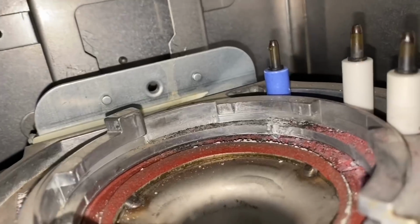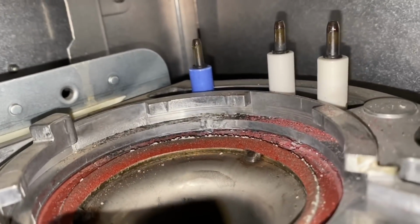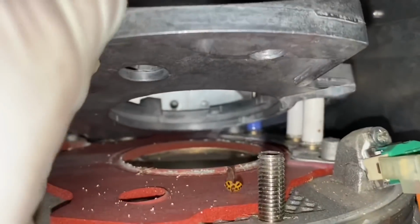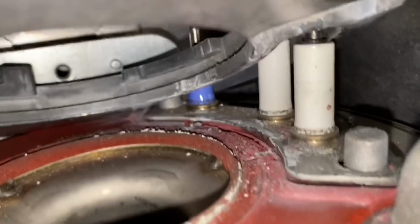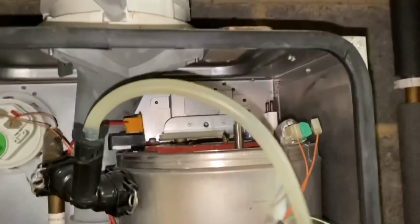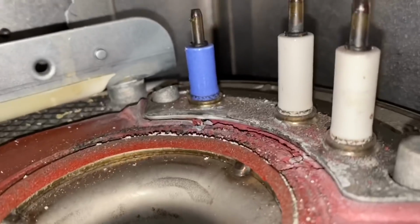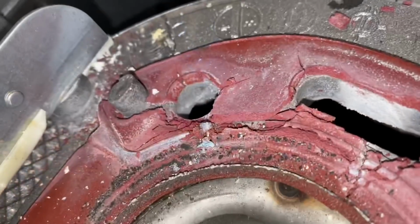We'll sort out the fan now. We have a look inside, we can see the burner seal there. We can see it's all deteriorated. So we'll take this off, take the top off here now. A little wasp or something there. But you can see it's not in very good condition inside. A little bit hot. As I say, that's the burner seal in there.